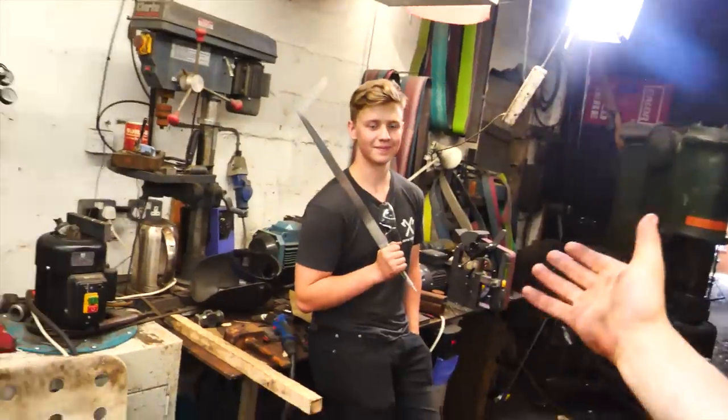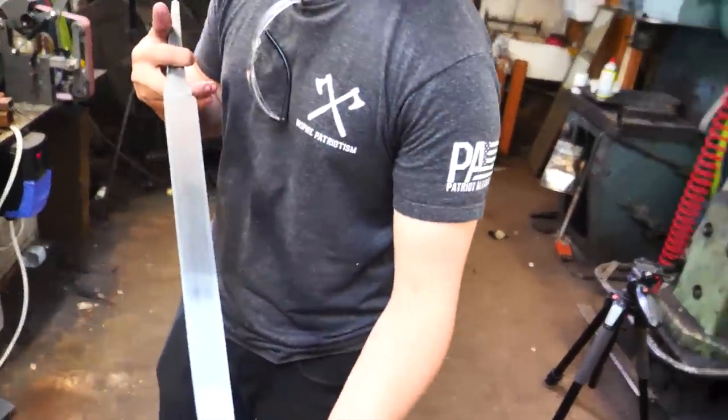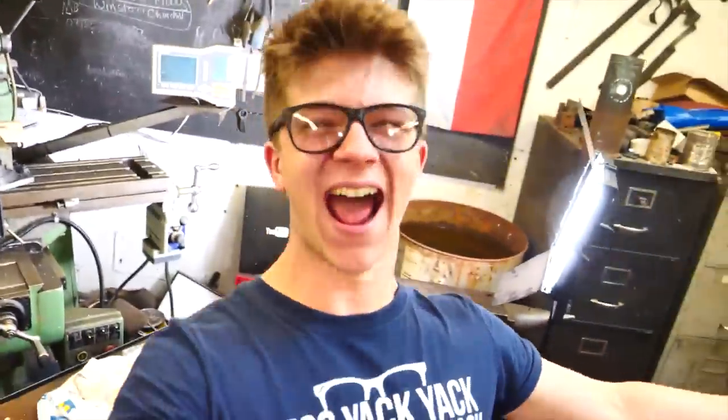Will, you did an incredible finish on that blade. It has 400 grit all the way up, nice longitudinal grind lines. It is looking sweet. What we're now gonna do is take our oxy-propane torch, lock this guard in the vise, and bend it into that D shape that it needs. This is very exciting because we're starting to get close to a finished sword!